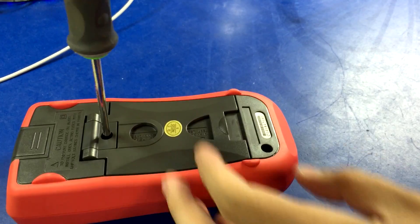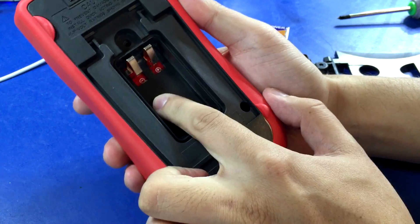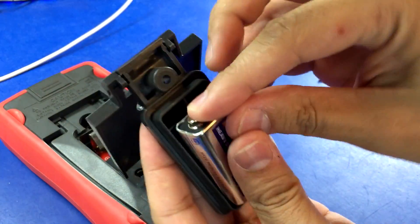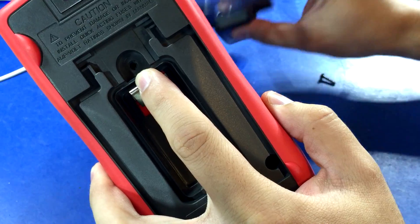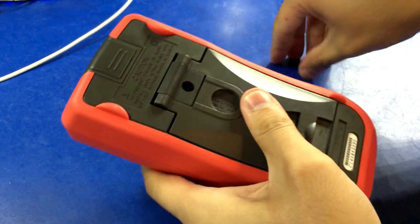It's time to test the battery and fuse access. So this is a UNI-T UT61E. Hard to tell them apart because they're nearly identical in size and shape. Looks like it's only battery access. It's a 9-volt and it's got tabs soldered to the PCB and this weird little carriage thing that holds it, and it looks like it is polarized so you can't hook it in backwards. Not a terrible design, but it doesn't go into a metal nut — just a crappy plastic self-tapper — and considering that's how you get to the battery, that's pretty shitty. Very bad UNI-T, very bad.